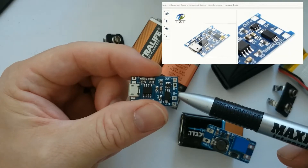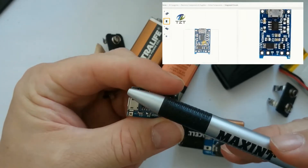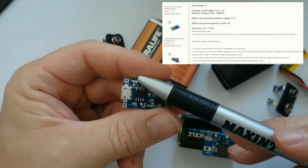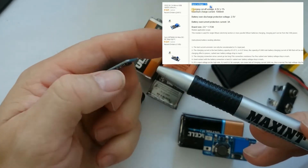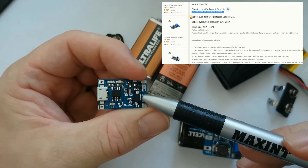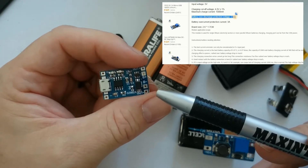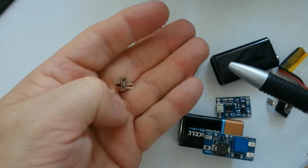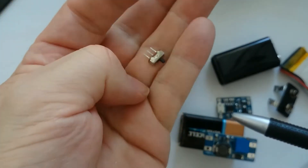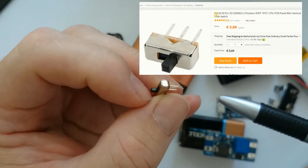I also want to have this port for the battery protection board. As you can see, it has the output pin, protected battery pins, the plus on the output. On this side you can see the minus for the input, and you can use the micro USB to charge it. When it's properly charged this LED will light up. This is the protection chip and it switches off when the voltage is under a certain level. Finally, I want to use this three-pin switch to switch off the boost converter so that it doesn't draw any power.